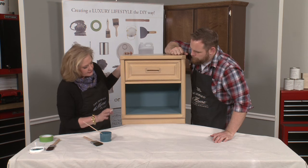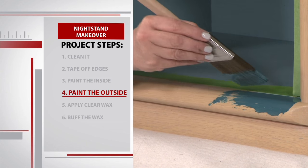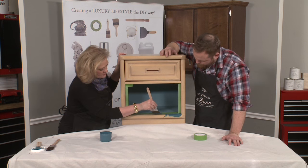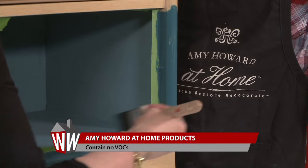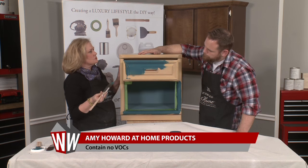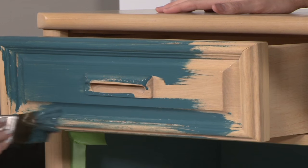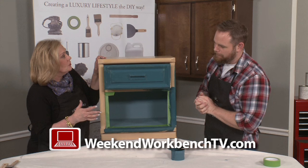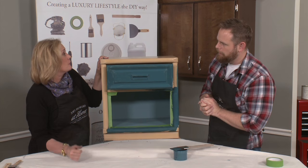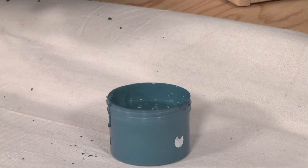Now we're ready to paint the outside — just a little bit darker color so they'll complement one another. See how I'm just going to run this edge? It's part of the reason why it's nice to work with an angled brush. I want you to do long, clean strokes. You can't mess this up — we just want to make sure there are no drips and a nice, even application. We're going to get 100% coverage over the whole thing, then do a second coat. It's going to take about 20 minutes to dry between coats, and then we will be ready to wax.